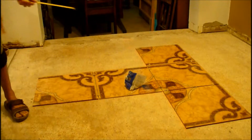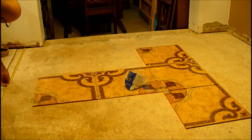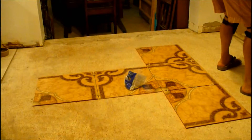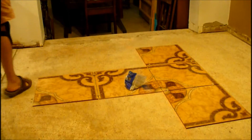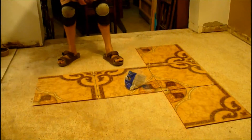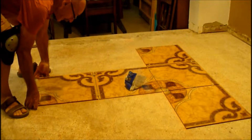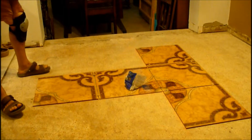I made more measurements — one from this wall over here, which is also going to be half, about forty-eight. And it should also be forty-eight over here. But then when I drew my chalk lines and started laying the tiles out, I noticed they weren't going straight. I had this lined up on the chalk line very nicely, and then I started putting these little quarter-inch pieces in. Looking at it, it wasn't following the chalk line. Something's wrong. So I did the three-four-five test.